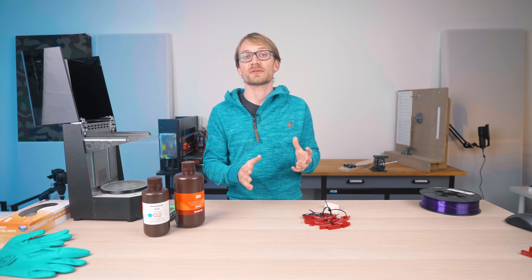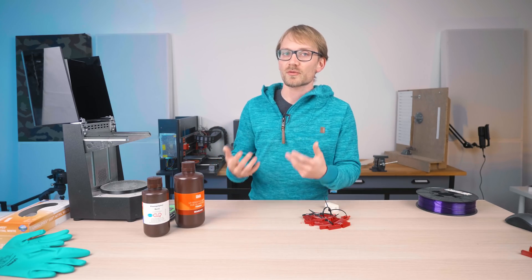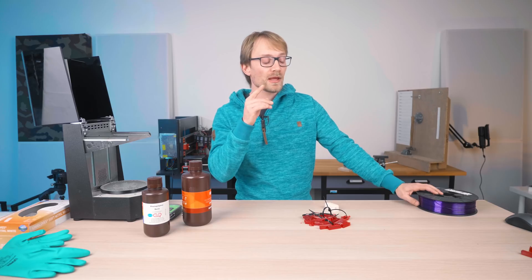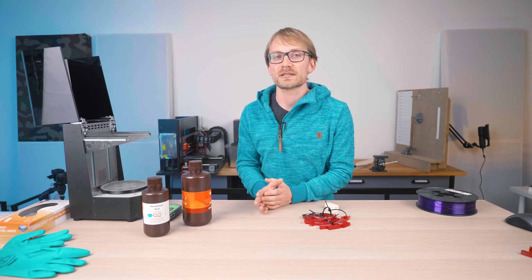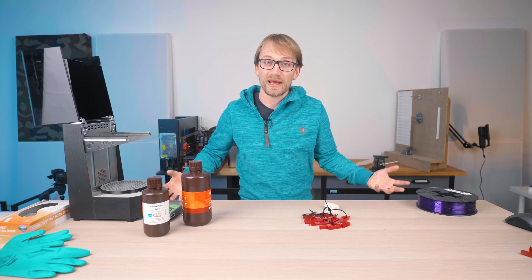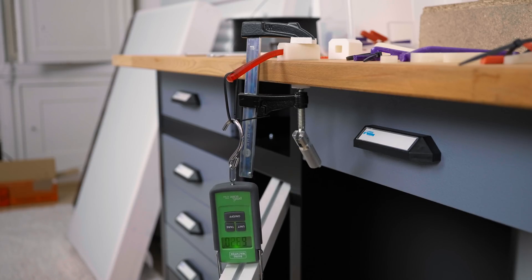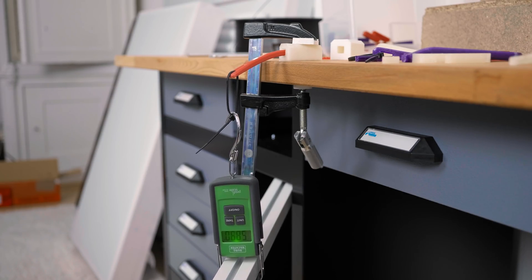Two videos back, I did a bunch of tests on whether resin or filament prints were stronger. The resins we use are commonly thought to be much more brittle than filament plastics, but resin prints have no layer adhesion issues, so I wanted to find out if that would actually make resin prints weaker or stronger in the end. It turns out the answer really depends — the Elegoo ABS-like resin slightly beat out PETG in almost every discipline, while the Prusa resin was considerably weaker in many use cases.